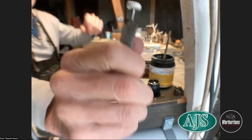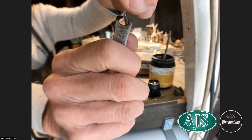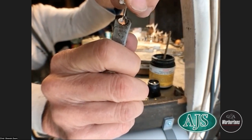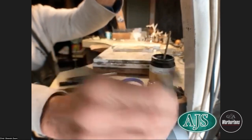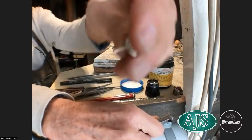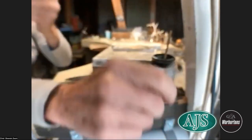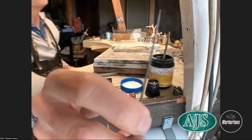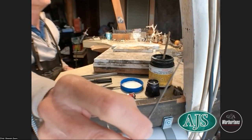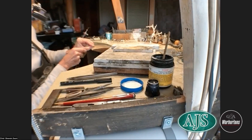Yep. And I'm now going to revolve very gently that wire with the minimum of pressure on the end cutters, and the sharpness of the end cutters will make a groove in the wire without snipping the wire off. I now have a little groove in the wire. It's very, very fine. You can just see there where the black mark is. And now I can go back in with a very fine escapement file, a super fine round escapement file, and I'm going to just open that groove out a little bit wider. But that cut from the end cutters gives you an excellent location point.